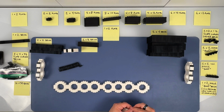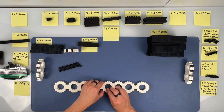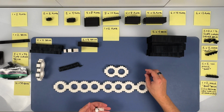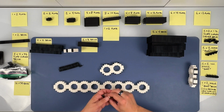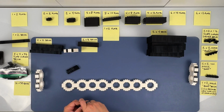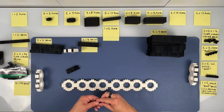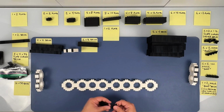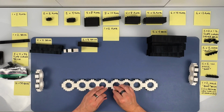The 3 that you see next to the rightmost digital plunger button are just menu buttons, and you can use those for pause, or you can use those for fast forward or slow down, or to bring up the tab menu, which you need for some emulators to play with the settings. So do whatever you want with that, but again, that's why I did the sort of 1 3 3 1 design. So you've got the front nudge, you've got the 3 coin and start and extra ball buy-in buttons, and then the 3 menu buttons, and then the digital plunger. So that's the method to my madness here.